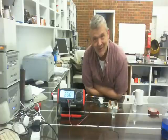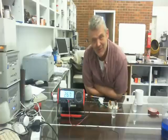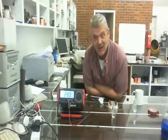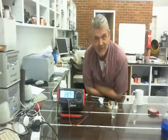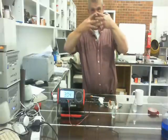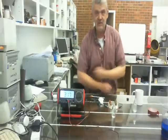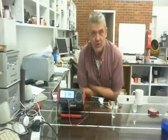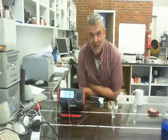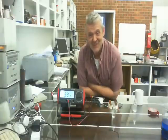Not being able to resist playing with this, I've stuck some titanium dioxide in there, and as you can see it's bouncing around 25 to 26. So for a simple device, that's pretty cool. Now obviously microamps is not huge, but apparently the amount of sunlight hitting the earth's surface on average is 100 milliwatts per square centimeter. So that'll give you some idea about the efficiency of this particular thing, which is quite poor. Now it uses something called interdigitation, which is where those fingers come down and you interlink the fingers, so it doesn't need a conductive topcoat — you don't need a transparent conductive oxide. But there we go — a very, very interesting mistake. I hope that you enjoyed watching, and thank you very much.